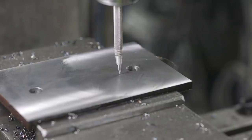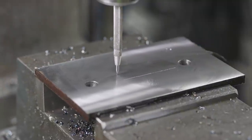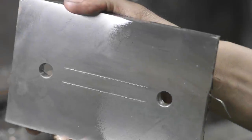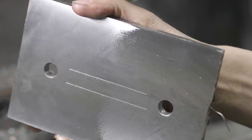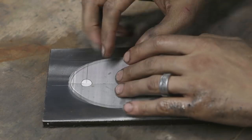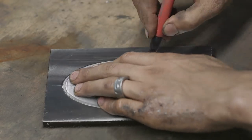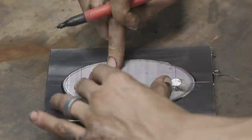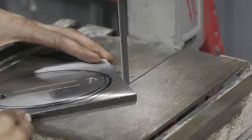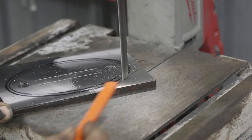Although unusual, I'm trying a new technique out. Basically what I am doing is using a scribe chucked up in the mill to draw some precise outline marks. These marks are going to help me line up the next piece that I'm welding on. This part calls for an elliptical shape. I designed this in Fusion 360 and then printed out a one-to-one scale ratio so I could trace it out, and then took it over to the small portaband to get it trimmed out.